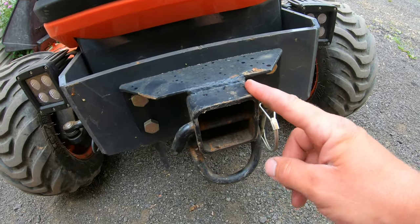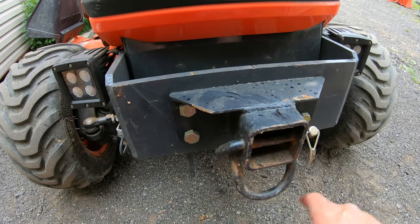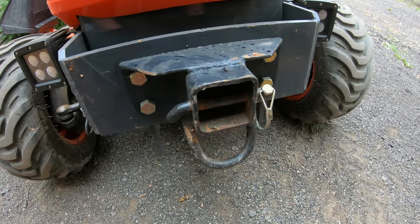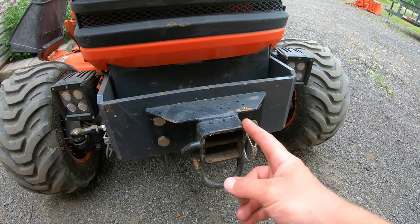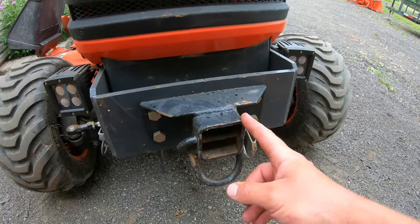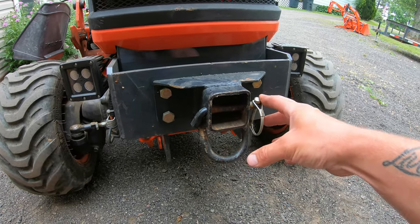You just got a piece of square stock, you got a piece of angle iron, and basically you just weld the square stock to the angle iron. You could drill your four mounts, and then if you want to add like a little loop or a little tie down point, you can. This is actually one of the first upgrades I ever bought for this tractor. Back when I bought it, I did not have a welder, so I had no way of actually building this myself. But yeah, basically I'm just going to be building a 2-inch hitch that'll slide right into this receiver, and